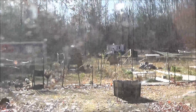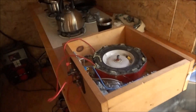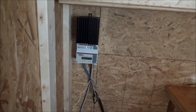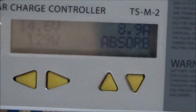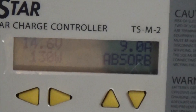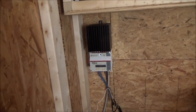The solar panels are in full sunlight right now — good sunlight today. All four panels are in bright direct sunlight. I've got my Bedini out and I'll be hooking that up pretty soon. I was clearing a spot for it. I'm still in absorption mode — 14.6 volts, 132 watts coming in, so it is limiting the power based on what I'm drawing.